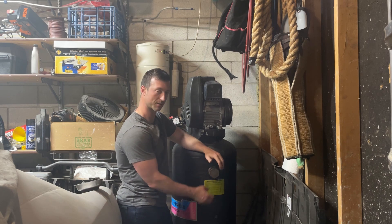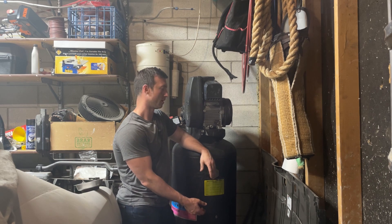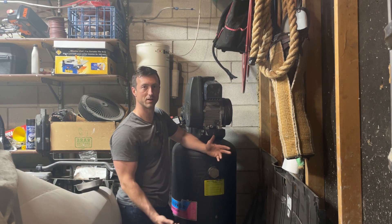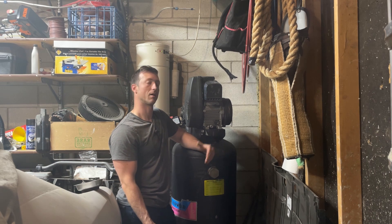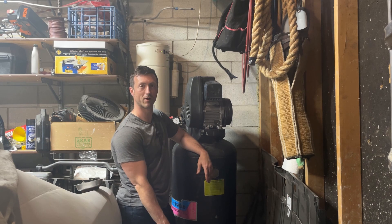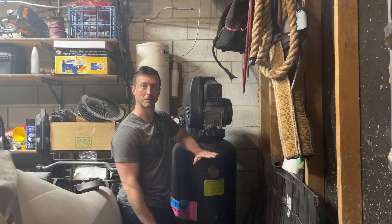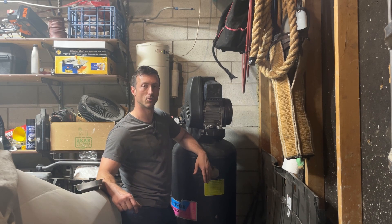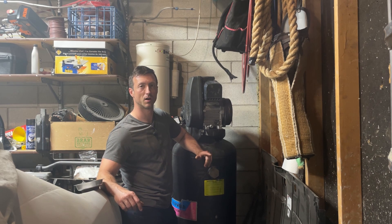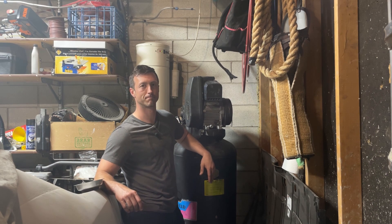If you have other things you do to maintain your compressor that I didn't cover, I'd love to hear it. Remember when you're done using them, it's always recommended that you drain them — you don't want to leave the compressed air in there because compressing air brings in moisture and you get condensation in the tank. You saw how much water came out of this one. The recommendation is to drain it at the end of every use. After this video I'm going to release the air and pop the drain valve to let any remaining moisture out. If you're following the Charger build, there'll be a couple more videos dropping soon on that. As always, leave questions below, like, subscribe, and see you at the next one.